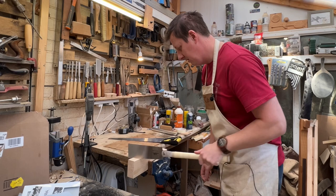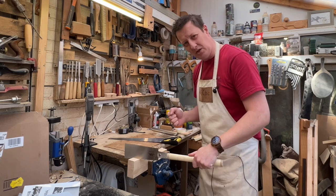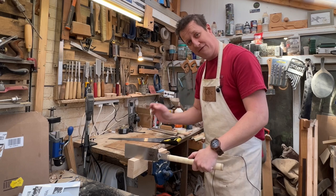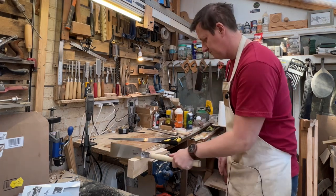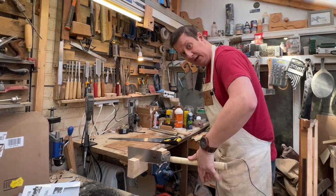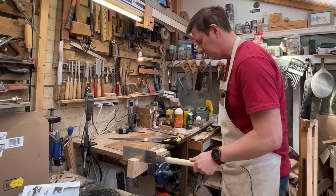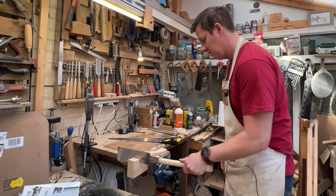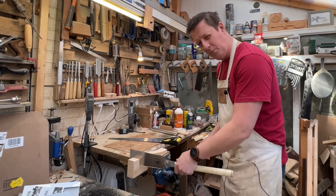It's really nice to start the cut. Often with Western saws, starting the cut takes a little bit of delicate work to get it in. This just seems to want to cut — that first initial stroke because it's happening on the pull just seems easier. Work in there with little finger and thumb to put the pressure on as I'm pulling back, not when pushing forwards. A delicate forwards stroke with a little bit of hand pressure and it cuts really cleanly and doesn't seem to get stuck.